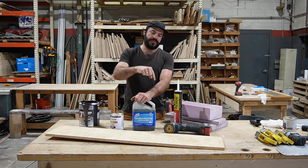So let's do that. Now, on this bus, because it's a conventional style bus and I've got this cockpit area, I don't have enough distance under my gas and brake pedal to actually run the full 4 inches of insulation from the back wall all the way up to the doghouse cover.